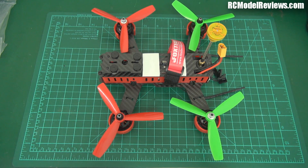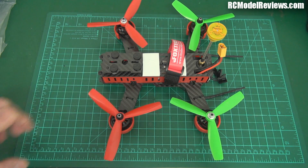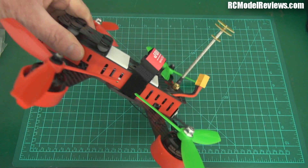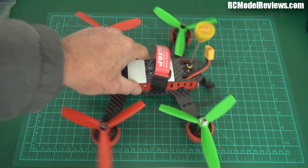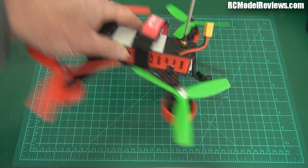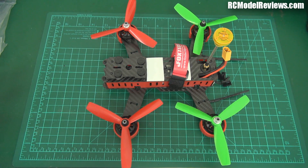In the last flight video, there's something wrong with the video - it's got massive patterning interference, little speckles and things start appearing especially as the battery starts to get down. That indicates poor power filtering, and also I think the video signal routing is not good in here. I replaced that dual-band piece of rubbish they provided with the Pagoda antennas, and that solved the dropout problems - full marks to those Pagoda antennas. I got a consistent signal but it was still filled with electrical noise from the internals of this machine.